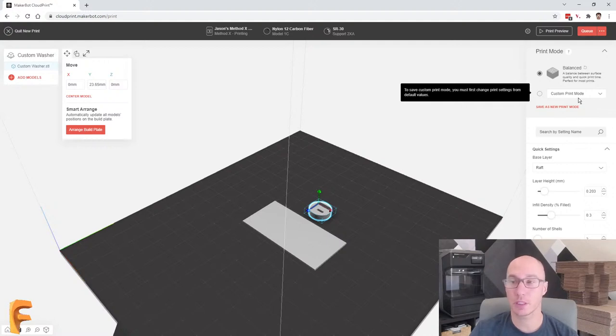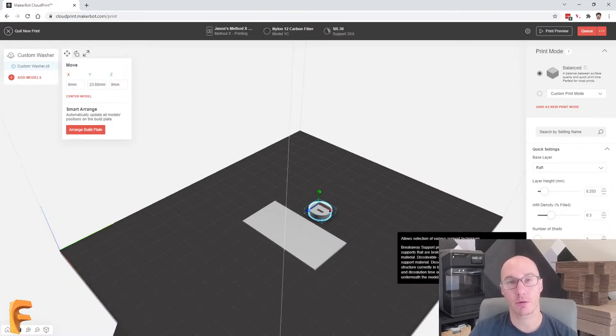So what I love about this particular slicer that comes with the MakerBot machine, of course, is that it just does it automatically. The settings that it puts in are standard settings that are tried and true and just work. If you do want to tweak them, you can, but for the most part, you don't need to. So when I'm printing, not under a big rush of trying to do everything in 30 minutes, which I'm already 2 minutes over on, what I would realistically do is just not change the settings. And what it will do is print a raft layer, which is like a base layer to make sure my part sticks to the bed very well. It'll use a dissolvable tapered setting on my SR30 supports.